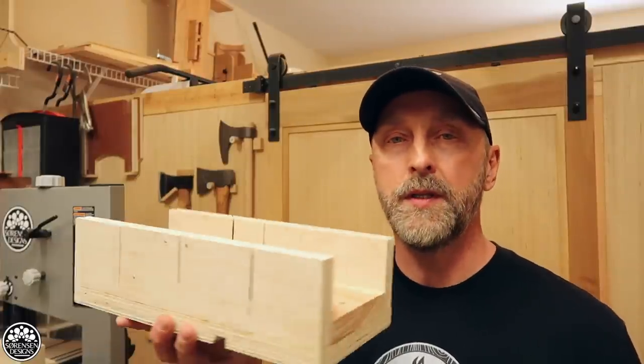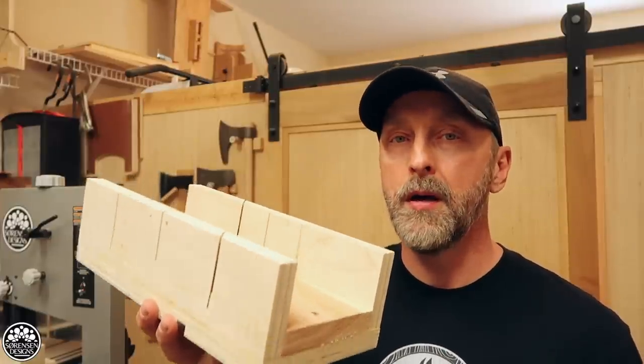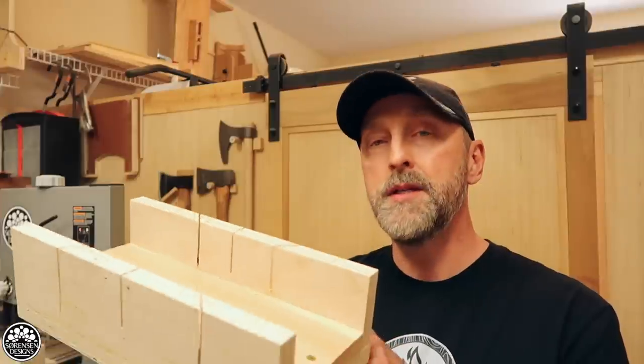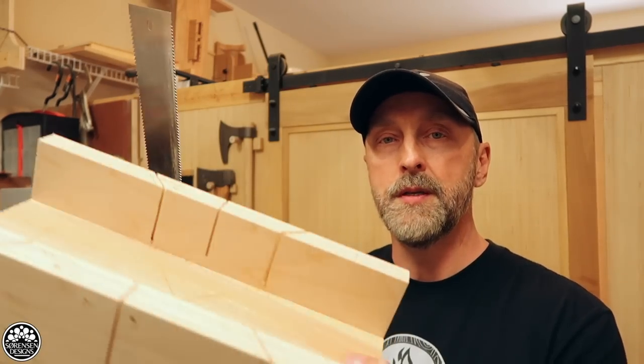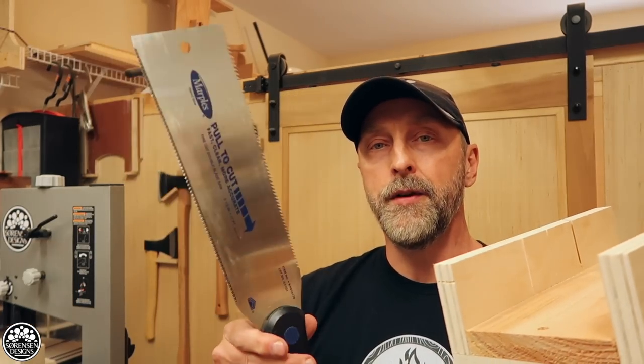You might ask, what's the big deal with this miter box? Why is it a precision miter box? Well, the miter box itself doesn't make it precise. Part of the reason why it's precise is because I use a 7 and 1/4 inch blade on my table saw, and by using that blade I cut a thinner kerf. I also use a Japanese style dual-edge pull saw, and that in combination with this miter box makes it a precision tool. For zero dollars you can build one of these, and between twenty and thirty dollars you can buy one of these pull saws. If you're starting out and budgeting your power tools, a power miter saw or compound sliding miter saw is really just a convenience — it's not a necessity for a wood shop when you're just starting out. The table saw is a much better purchase; I always find myself doing much finer work on the table saw, and really the miter saw is just a convenience.